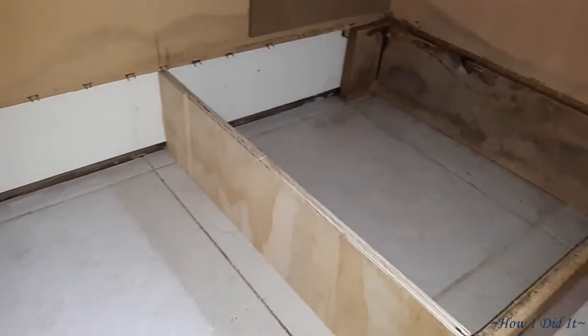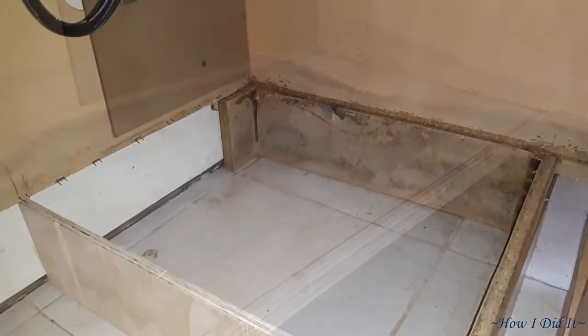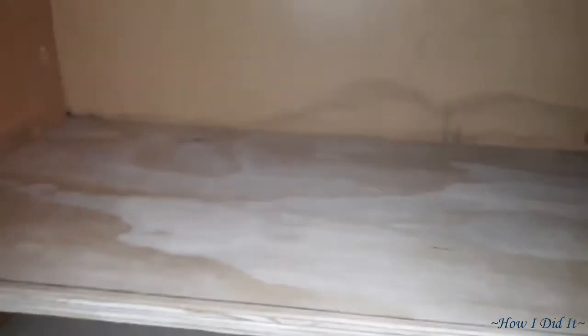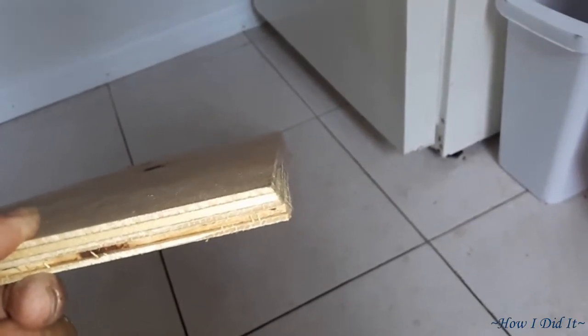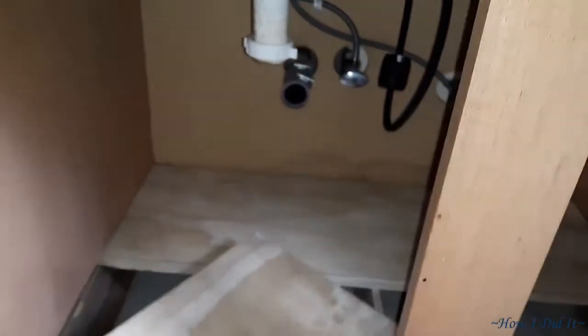So I bought 1/2-inch plywood. I put a center support across there, and then I measured my length by my width, cut that rectangle out, and I added 1/8 of an inch on either side, so it's not all the way to the recessed opening, and then I did a bevel cut at 30 degrees right down the center. Now to get these in here, I had to kind of flex them pretty good and then hammer it down.